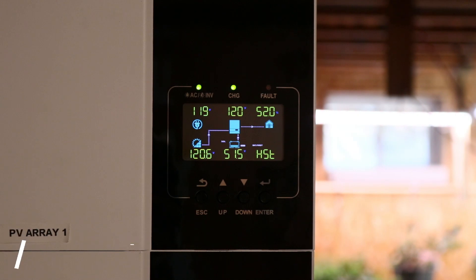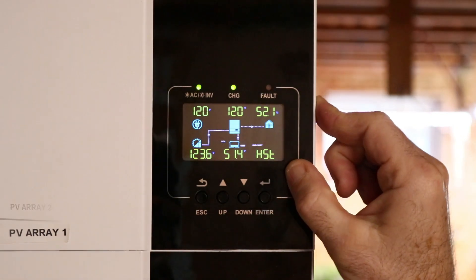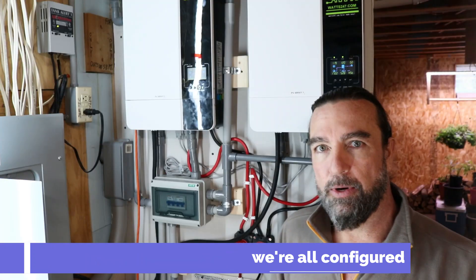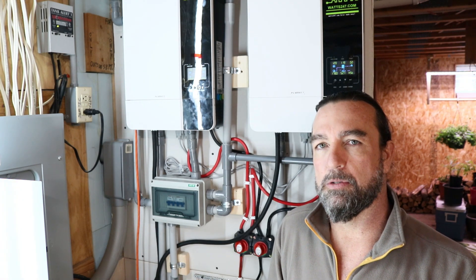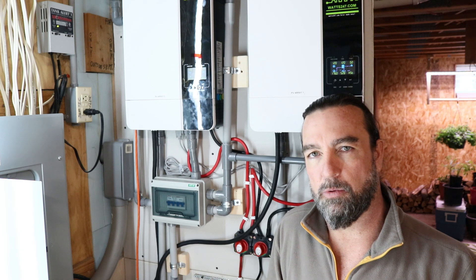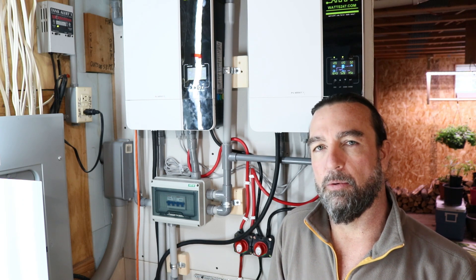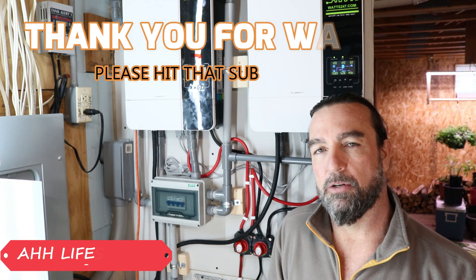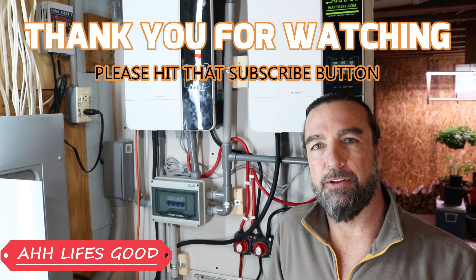As you can see, we have our first inverter set up on 2P0 — you can see the digital display — and the second one in the series says 2P2. It really is that easy. Remember to shut off all the power going to those inverters prior to doing any of these installations, especially that communication cable. If you have power on those inverters when installing the communication cable, you could burn up the communication board or circuit within the inverter. Make sure everything is off before you install everything and turn it back on. Happy DIYing, guys — we will see you in the next video, thanks for watching.